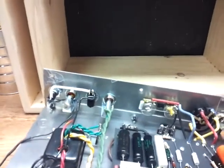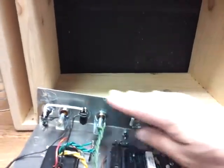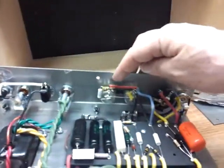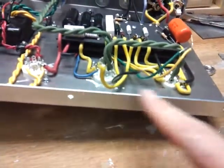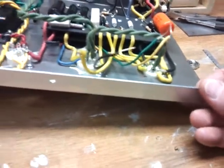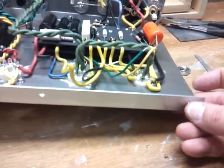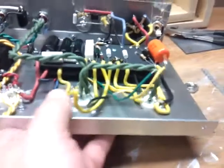And then you take the 6-inch piece of steel, cut it to the same width, and then cut it right down the middle for 3 inches. You can see there's plenty of work surface in here. Then you get yourself some L bracket, I guess it would be a drip edge or something like that. I think it's about 1 inch high, and then you drill it to pass some screws through.